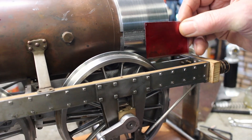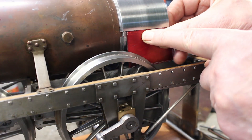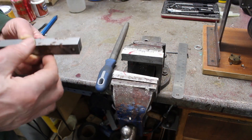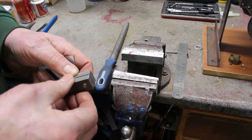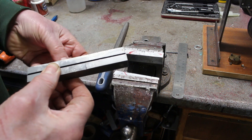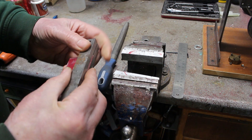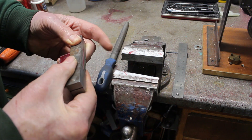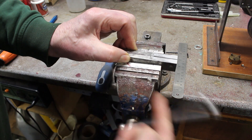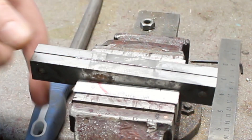I'm busy making the side plates for the smoke box which go on there, so they just need filing to size. To assist with the filing I just have a couple of bits of bar with two pins through, and I can just separate those and put the material in. Line it up with a scribed line. Once it looks okay, put it in the vise and give it a file. Obviously this gets file marks over time, so every now and then I just give it a trim up in the shaper.